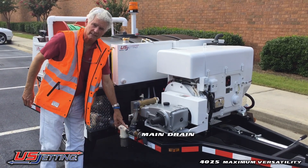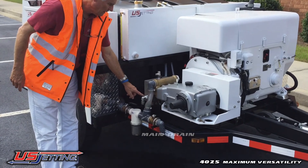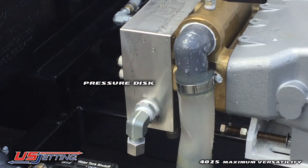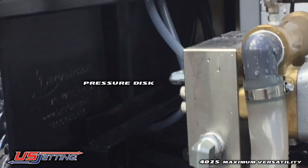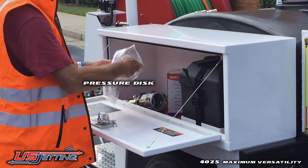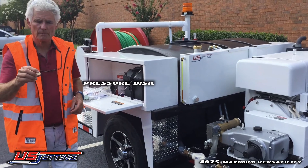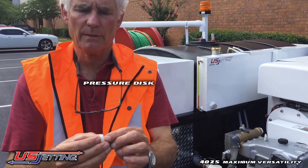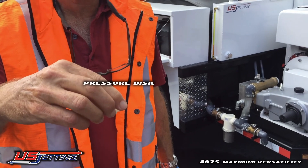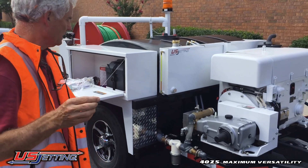This is your drain to drain the water tank at the end of the day. Next is the rupture disc. If you over-pressurize the system, this rupture disc will blow. You've got spare rupture discs in the toolbox. This is what the rupture disc looks like — it's got a little nipple on the end, and it's important that that goes down that way. Always keep some spare rupture discs in the toolbox ready to be inserted.